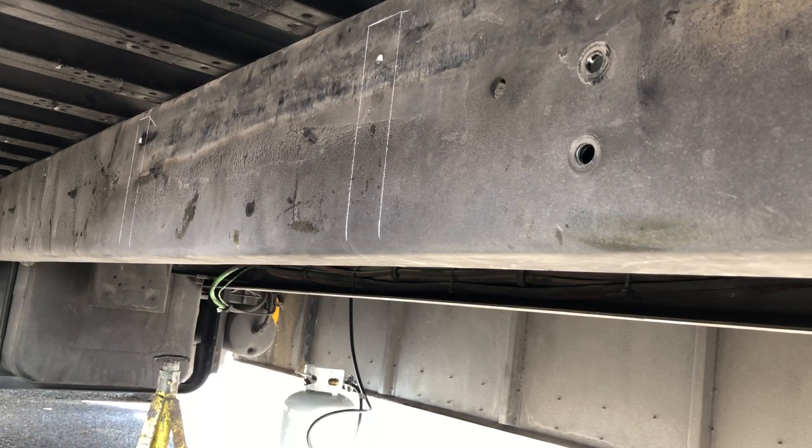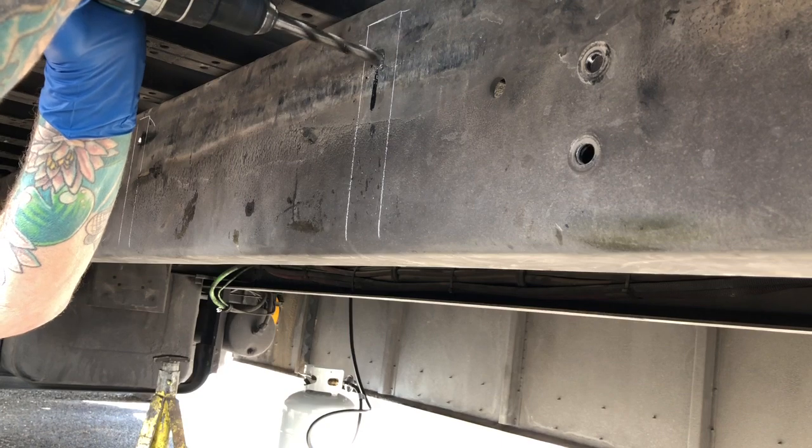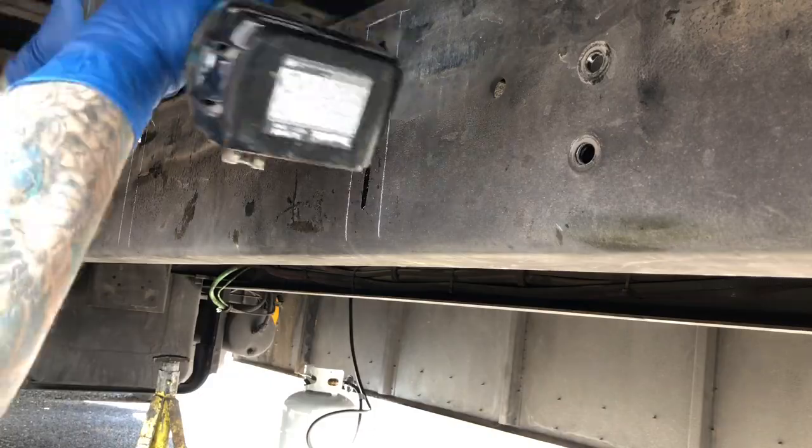Just got to get these three holes drilled out to a half inch and I've got it made for the drilling part. Joe just touched this bit up for me again. If you're doing this and you want a tip — slow your drill down. After I burned up a few bits on high speed I remembered: this is a two-speed drill, I could shift down to low gear. That's probably all you need to see of that.